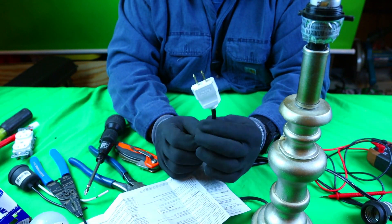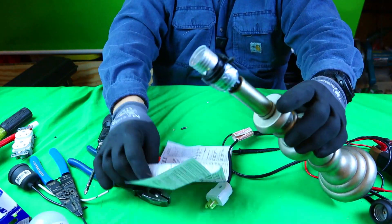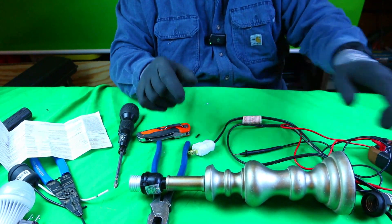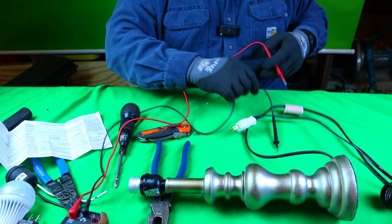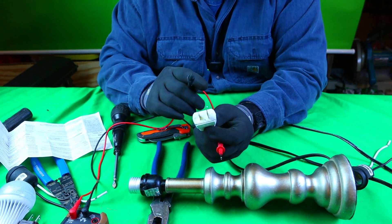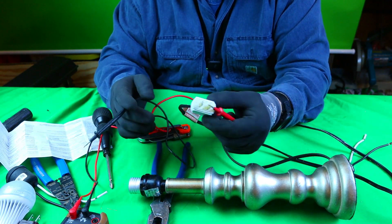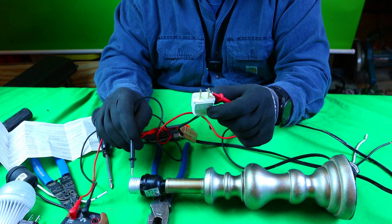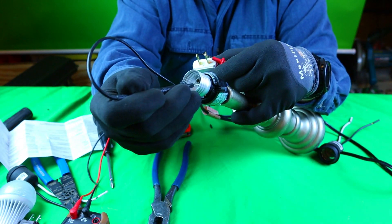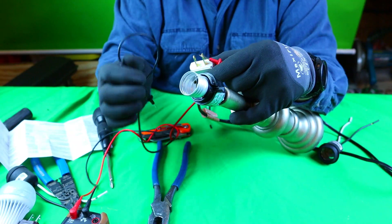We'll squeeze it, put our screw back in — it only goes one way. There, we are done, and it is perfect. Now we'll plug it in and see if it works. But before we do that, let's double check — it doesn't hurt to double check. We're going to take our meter once again on continuity. Make sure our meter works like we did last time. Now we know that this plug is polarized, so this side is the biggest. If we go right here to here, it should be through. We'll put the lead right into the hole of the polarized plug. And just for giggles, we're going to stick it while it's on the neutral side — we're going to make sure it ain't hot. And it's not. I'm on the brass. But if I touch the outside, it definitely beeps through — there's continuity.